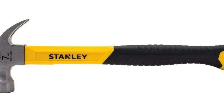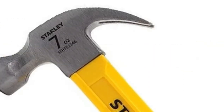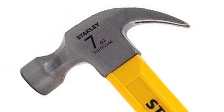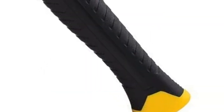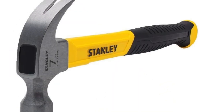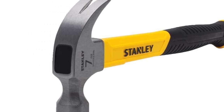It's nearly an inch shorter than most of the other hammers we tested, and you can feel the lack of leverage when you're trying to get some power behind your swing. The worst flaw with this hammer is that the head is attached with epoxy. After only a few hours of use, the head was beginning to get loose. We didn't want to give it the chance to come off and cause an injury, so we stopped using it. For the price, there are much better hammers available, so we don't recommend this one.